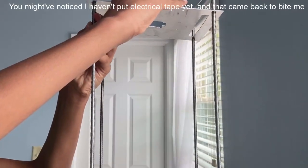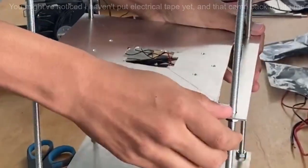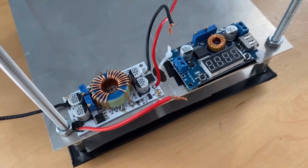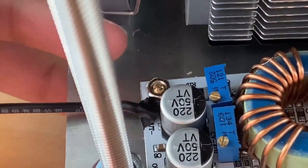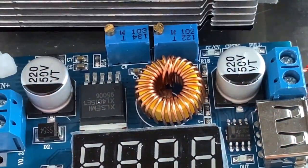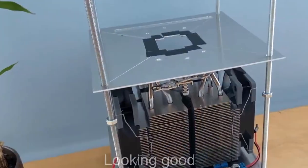Now we can add the LED layer right above where the heatsink will be. It's also a good idea to screw or cable-tie in a voltage booster for the LED and a voltage step-down board for the fans, although make sure your heatsink and fans leave enough room for these boards to be mounted securely.